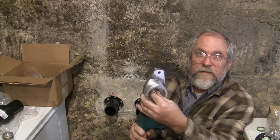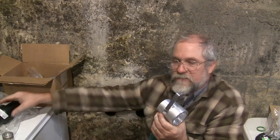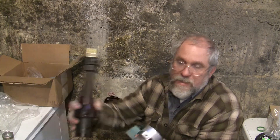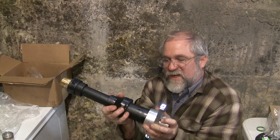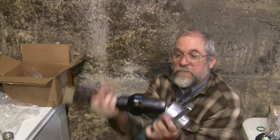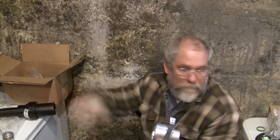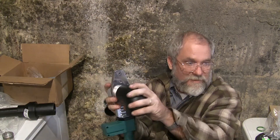These dies are spun very carefully on a lathe to be just loose enough that you can insert the fitting with a press fit while it's cool. With a press fit, it takes a pretty good amount of force — but there we are. The fitting is inserted, just barely. And then on the other side, we're going to be attaching this elbow, and it press fits onto the other side.